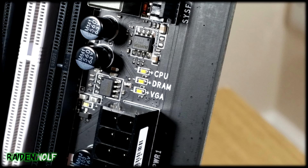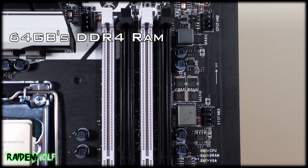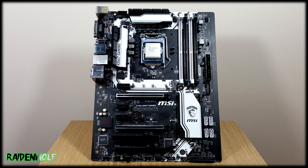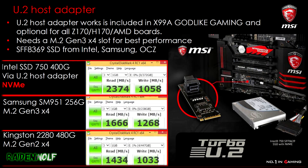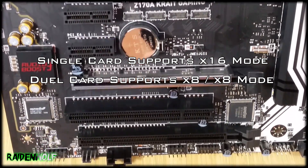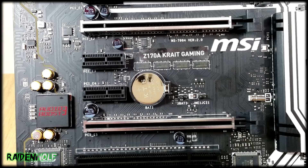To the left you have four DIMM slots supporting up to 64GB of DDR4 RAM, from speeds of 2133MHz up to 3600MHz, with isolated memory circuitry for great performance. Below the LGA1151 socket is the Turbo M.2 port at 32 Gbps, which also supports the Turbo U.2 host card. The motherboard has three PCIe 3.0 x16 slots: single card runs at x16 mode, dual card at x8/x8, and triple card at x8/x8/x4.